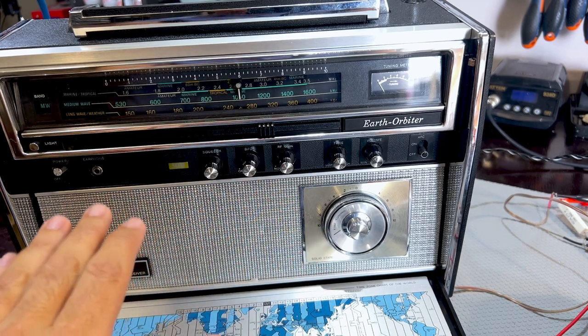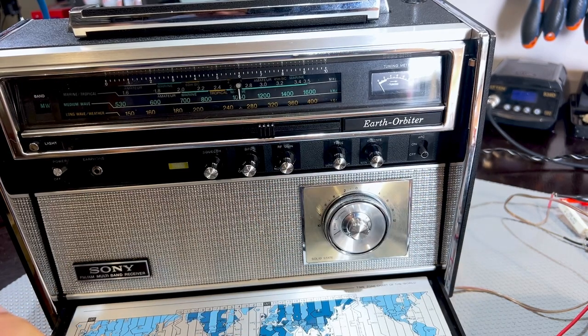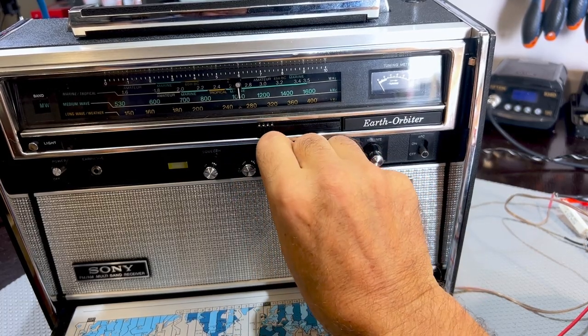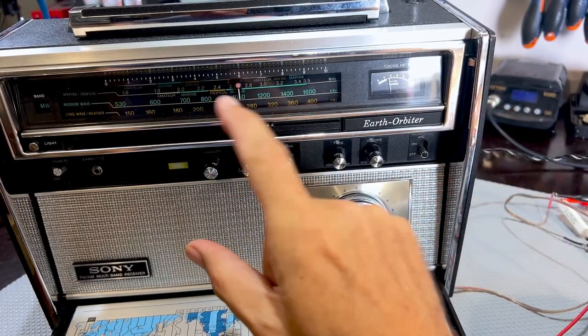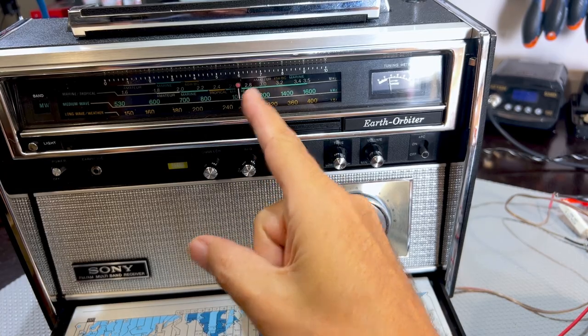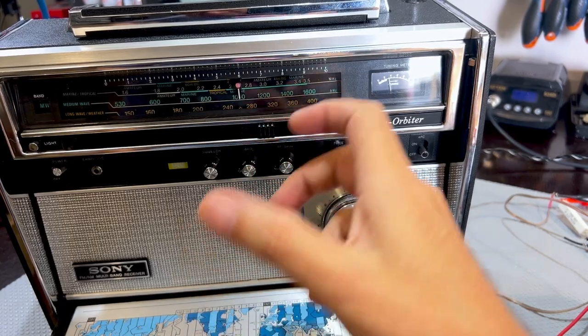So when you're playing with these radios and you want to use, especially if you're using a coil to induce the signal onto the ferrite antenna, be careful with this. If you leave this on automatic, everything will sort of sound the same. So there'll be like, it's almost like automatic frequency control. There'll be a big span where the amplitude stays the same, even though the filtering is reducing that amplitude, but the automatic gain control is stepping it up.